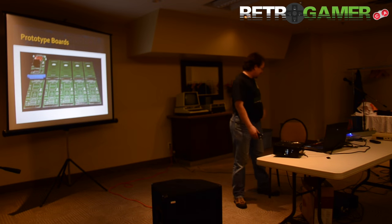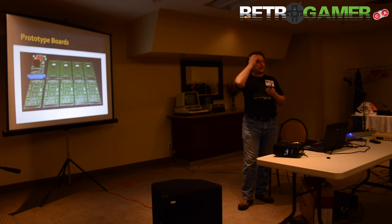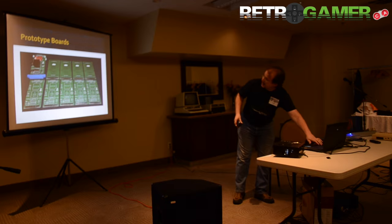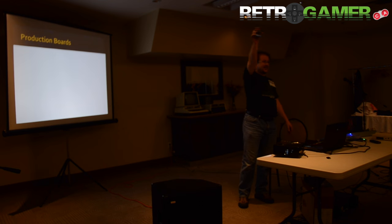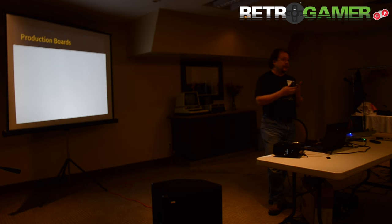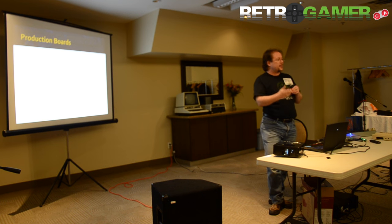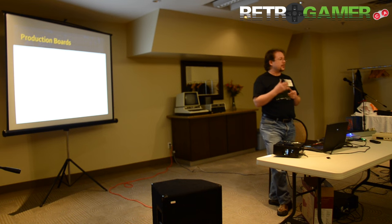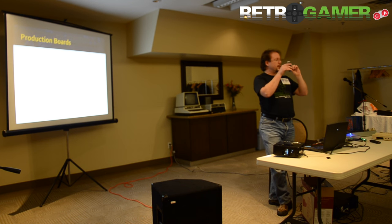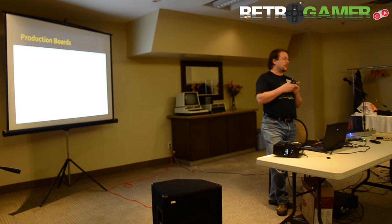This is the first circuit board I ever designed — it was a learning exercise for me to learn how to design PCBs. I showed it to a few people and everyone said 'okay where do I get one?' So I made some prototypes and had Alex, Frank, and a bunch of folks test them and took their feedback. I went through four iterations. The first was full of mistakes — I couldn't connect any of the grounds together. The second corrected those mistakes, the third added UP9600 support and was pretty much final. The only addition for the fourth was a jumper to disconnect from the Commodore user port power for external power use. The color changed too — the first was purple, then green, now these are black.